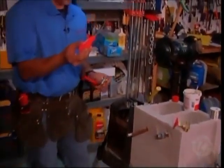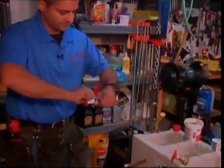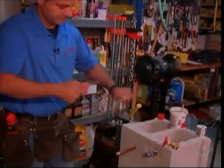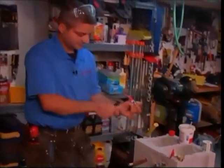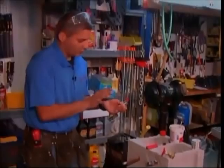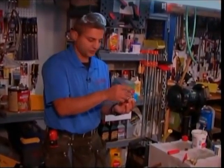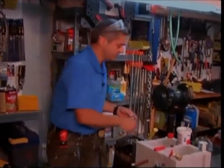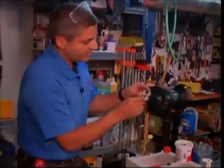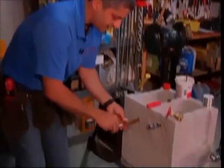Here's the second tool we're gonna use. Really important, I can't stress this enough. You have to be clean. Both sides. Now always solder with the valve open. If you don't solder with the valve open, you're gonna damage the internal components. So keep it open. Now we're gonna put some paste on. Generous amount of paste. Get that on.